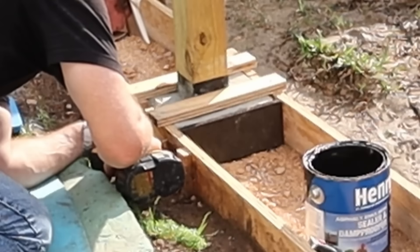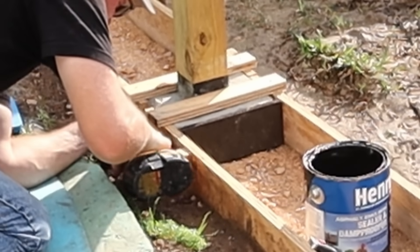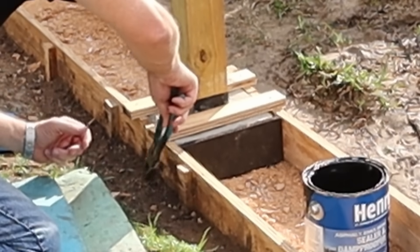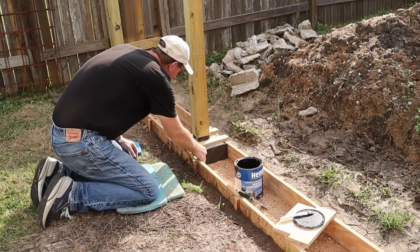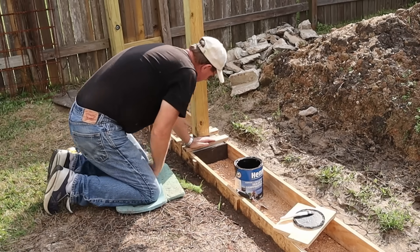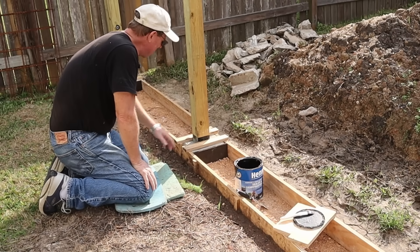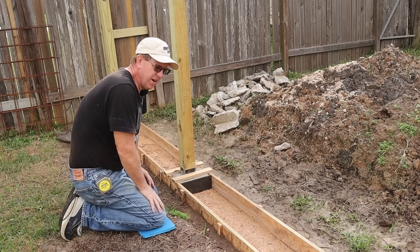I'm taking a five-thirty-seconds bit and drilling through the plywood and into the expansion joint. Then I'm just taking some 4D inch-and-a-half finish nails and sliding them in the hole. I'm leaving the heads sticking out so I can pull them out later. It's flush here, glued against here really good, and flush over here — when the concrete pours, it won't come up. I'll put the material I pulled away from the edge back up against here, tamp it in place on each end, and then when I pour, it can expand and contract freely.